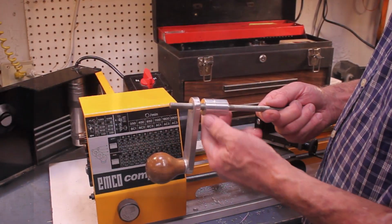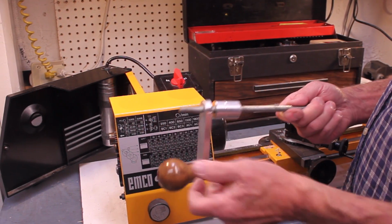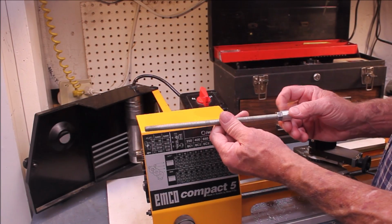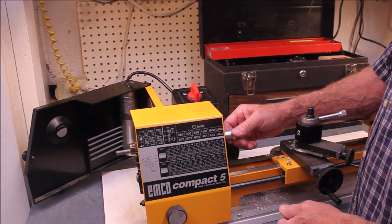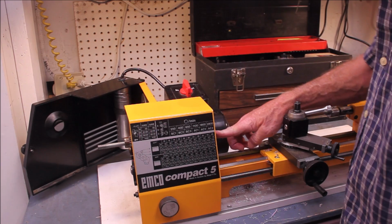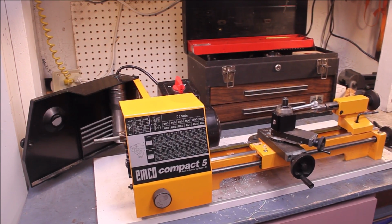This hand crank system is nothing. It's just a spacer here, a hunk of aluminum, a knob, threaded rod. The trickiest part probably is this little bit up here. This has got to be an MT2 taper. Doesn't even have to be real precise, but something close. It's got to slide in there really well so that you can still get the lathe chuck on the front.